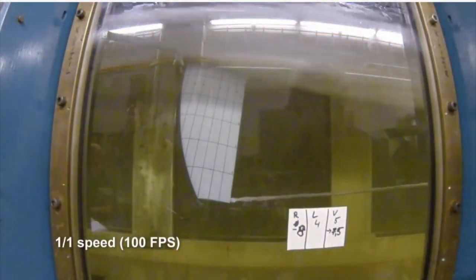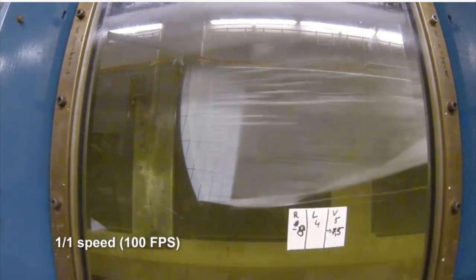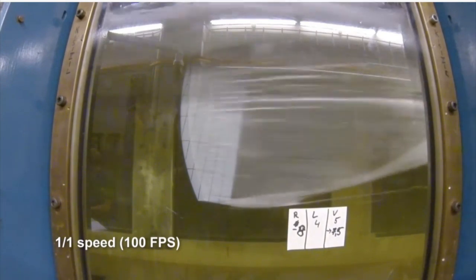The typical problem is for the rudder, which occurs mostly on a moth, for example — boats that have the foil and the rudder in line with one another. The flow from the foils is substantially close to the foil of the rudder, and if they are close to the surface, in the wake of the foil there are some bubbles. When the flow arrives at the rudder it includes these bubbles and creates a path for air to be sucked into the flow, so you no longer feel the rudder because all the flow around it is air — it's like you are moving the rudder inside a bubble of air.